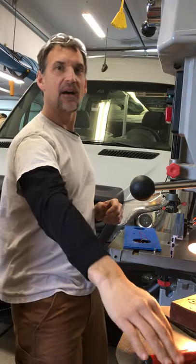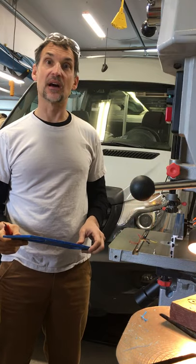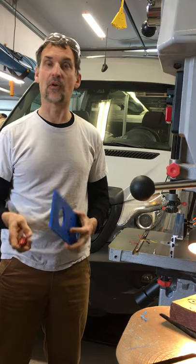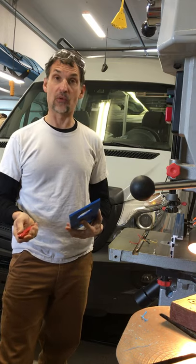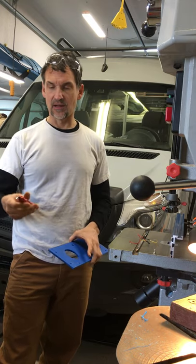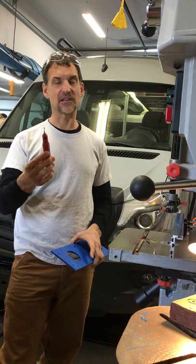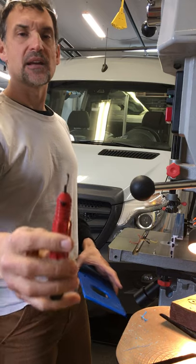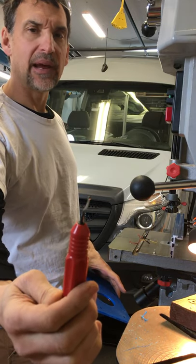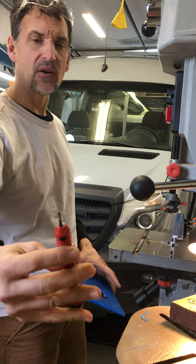Hello, Casey here with a little new tip for the day. When building out panels, whether with plastic, wood, or metal, one really great tool I found is essentially a reaming or countersink tool. This is the tool right here — it's got a great little really sharp curved blade, and this curved blade is really made for countersinking holes.